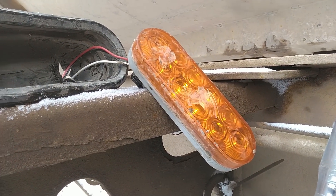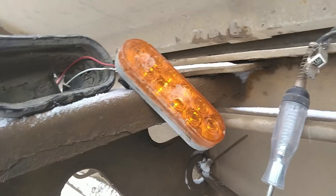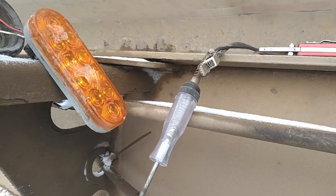And look at that — our light's no longer flickering on and off. Wiggle this wire, nothing happens. I get asked all the time about dim lights or lights that are flickering or intermittent on and off. Unfortunately, there's not really a whole lot of shortcuts to fixing the issue. You just got to trace down the wires, find where the wire is damaged, corroded, and repair it. There's no real shortcut besides doing that — you're going to find something like that, or damaged wire, or somewhere that the insulation is nicked and the wire is corroded. Sometimes it just takes some time to search through and find the issue.